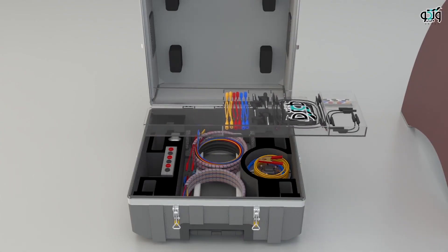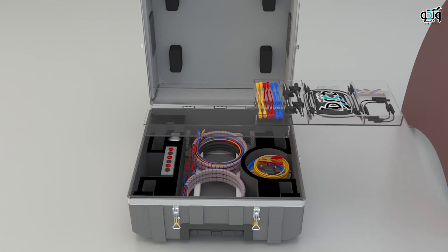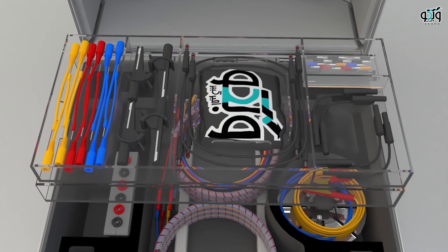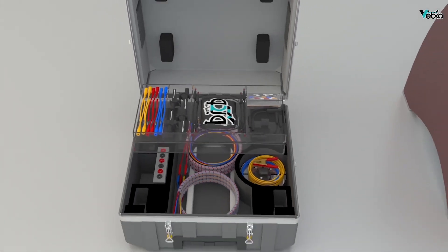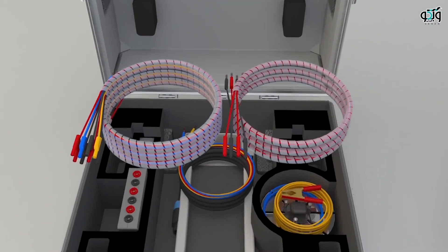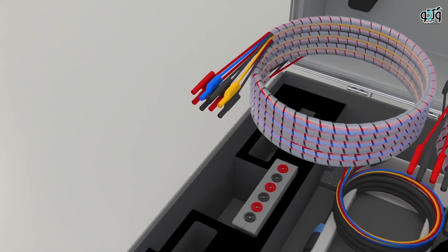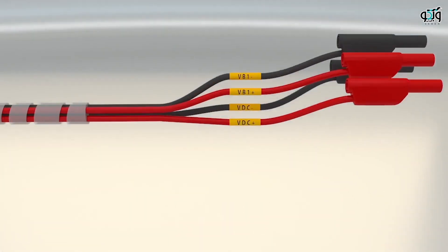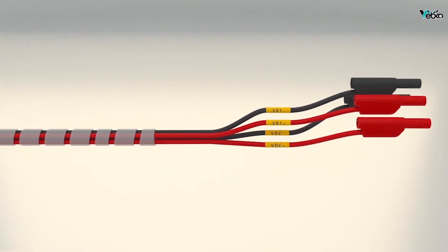This glass box includes one side socket, one side wire, long wire, crocodile clip, 30cm test wire, 10cm test wire, 4mm test socket, and cable tie. Other pieces of equipment that come with the device are communication cables, which are used for communicating with the relay and injecting voltage or current. The side of the cable with a fixed head is connected to the device, and the head on the other side, which has a dynamic plastic guard, is connected to the equipment.